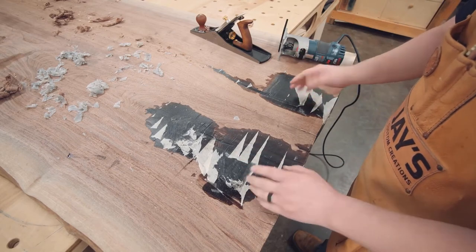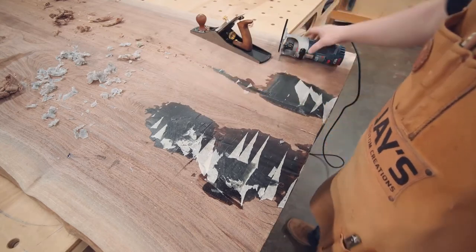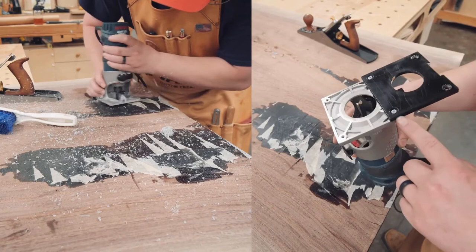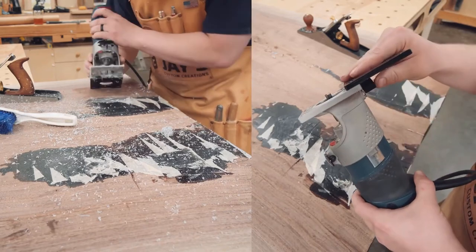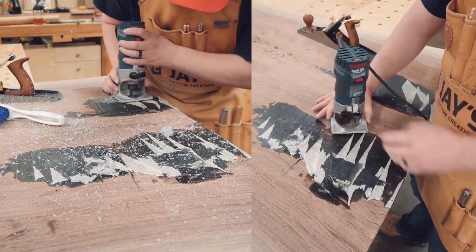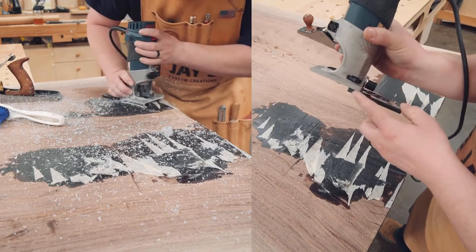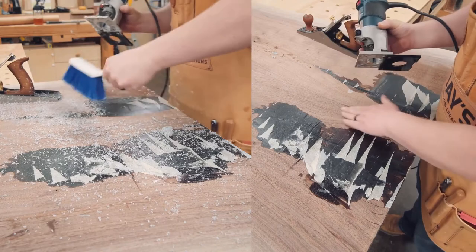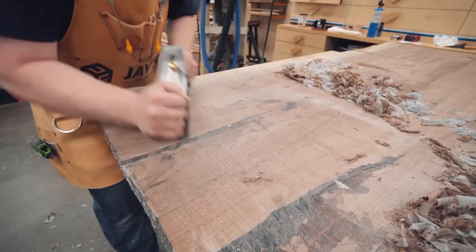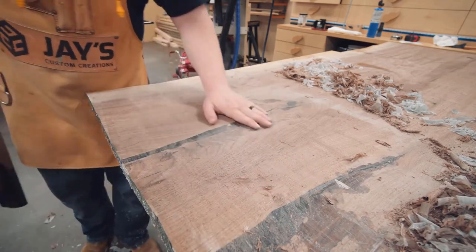This is relatively easy to clean up - I've already been shaving it with a hand plane and it works quite well, it's just a little slow. What I'm going to do first is use a flush trim method with this laminate router - I've offset the base so it's kind of cantilevered over when in use, and I can set the router bit height just short of the surface. Because this is a DIY setup there's a little bit of flex in the connection, so I'm not going to go all the way to the surface - I don't want to gouge into the walnut. I just want to get it close and finish it up with the hand plane.